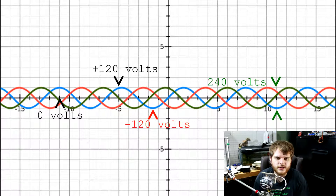So you have the original, then one shifted, and then another shifted. That last one is actually completely inverse of the first one. This allows the device to draw more current than if the device was just on one phase. Now this is good and all, but where it really helps is with motors.